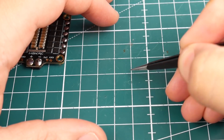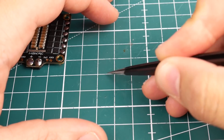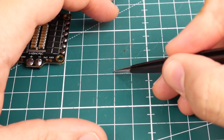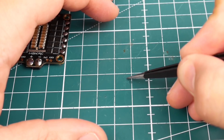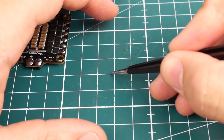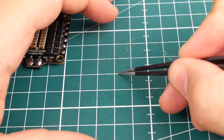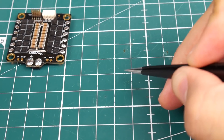On the line, let's say this is zero volts or full battery — a perfect flat line means perfect voltage with no noise. The current result was doing about two volts up and down, so four volt amplitude — two volts up and two volts down. Each square on the scope is five volts, so if the line dropped to here that's a five volt drop from full battery. So it's going pretty beautifully, within a two volt range — that would be almost a perfect test for a single ESC. But you see these little crazy wiggles every once in a while — that's the noise, the nasty stuff you don't want.